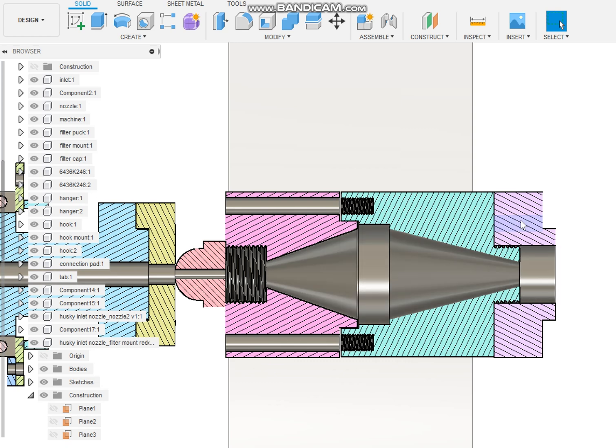So then I decided, well, just leave the nozzle adapter on there. That's what every other barrel adapter, I should call it, that's what every other machine you have has on it, is 1 3/4 8 on the end of the barrel. So I left that in place, flipped this thing around so you can push the filter out, and then turned it down to put threads on it.